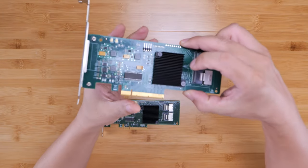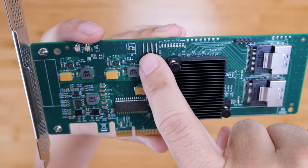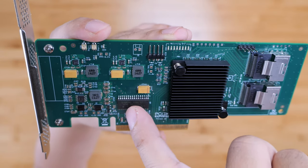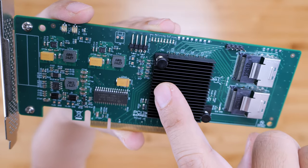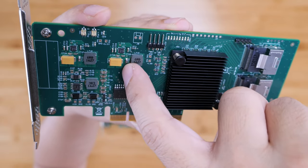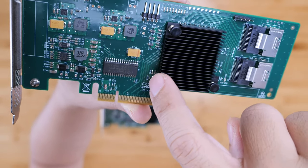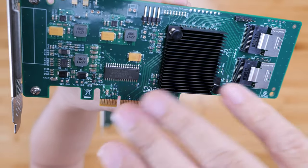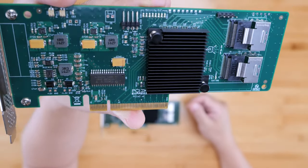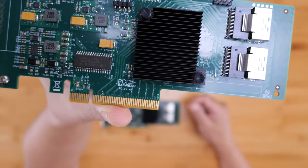So if you now look at the suspected counterfeit card, everything, so these four pins have a silverish color. All the touch points have a silver color. And I don't think that's just tinned traces, because if you look at the traces underneath this green as well, they're very bright instead of a dark brown. So it almost seems like it's a silver trace with this green coating on it, right? So that seems to be something that I didn't notice before.